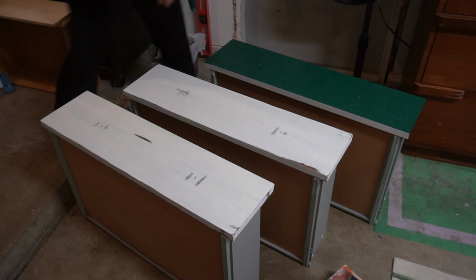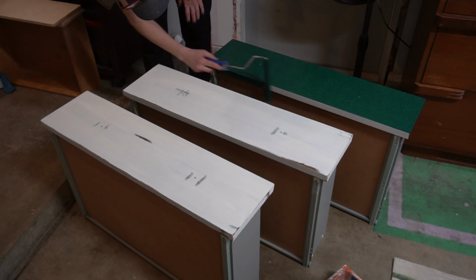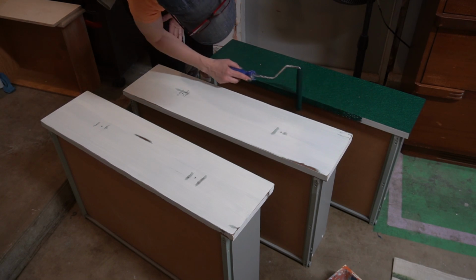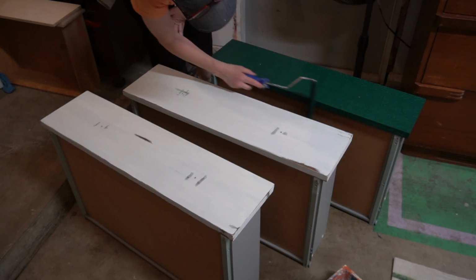I used this low nap roller because it usually leaves a really smooth finish, and this time was no exception. Plus, the drawer faces extend beyond the drawer, so I could roll on everything, including the edges. Score! Even if it looks like AstroTurf to start, I knew that it would actually work out in the end.